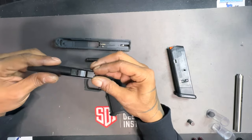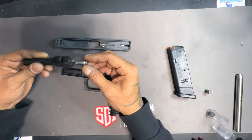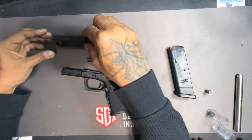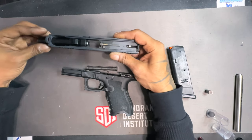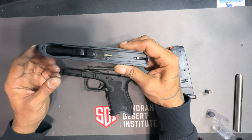I'm going to remove the barrel and remove the go gauge. Now I'm going to take the no-go gauge, place it inside the barrel with a light push, and just as I did before I'm going to slide the barrel back slowly.